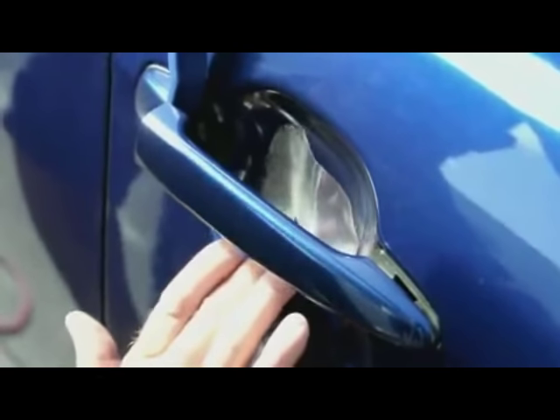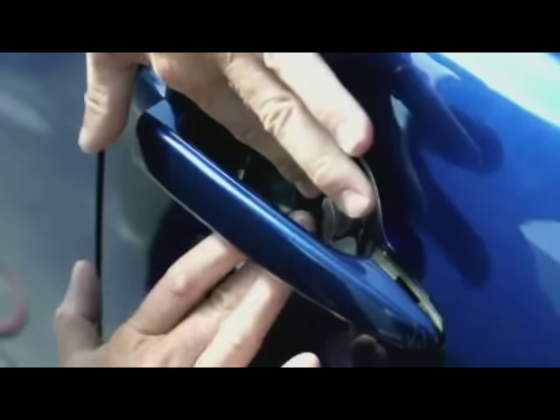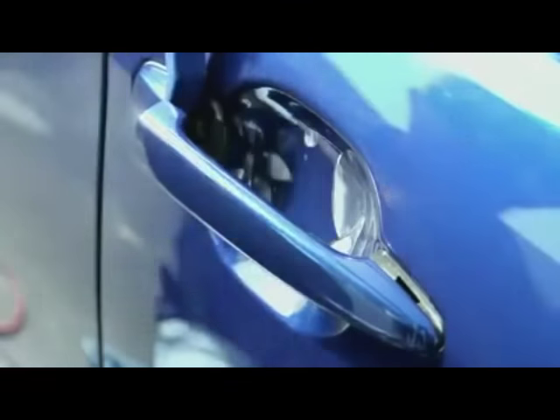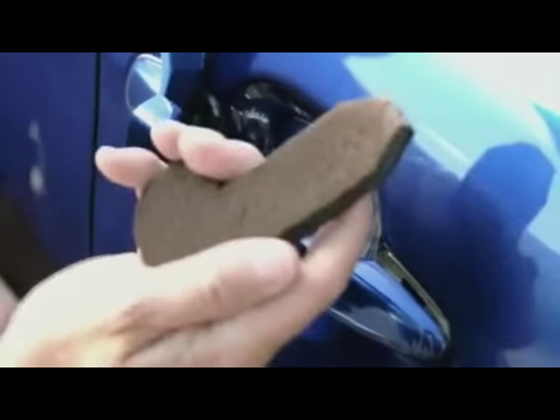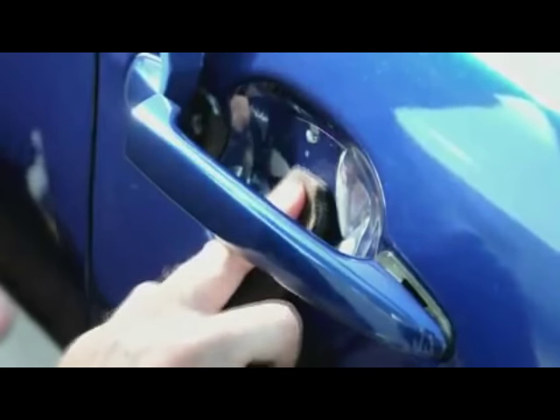You want to work from the middle out when you put this laminate down. So you get it nice and tight there with your fingers. Then we have a little tool that we use — it's a piece of felt. It's got some curves on it to do different things. And when you push with this, you can push very, very hard and it won't scratch anything.